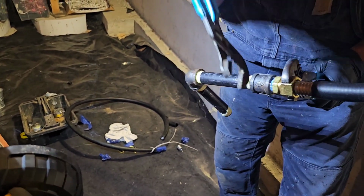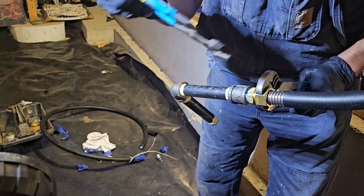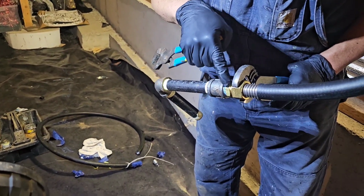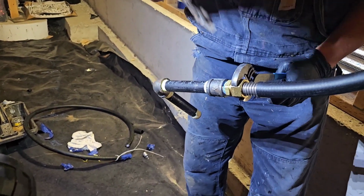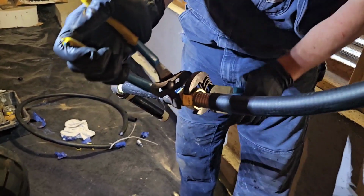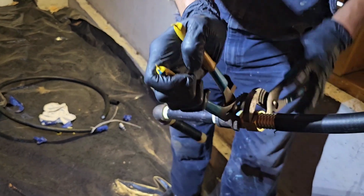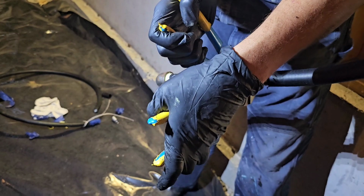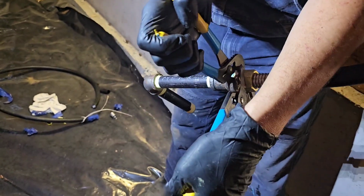Important to tighten the nut too, the nut, not the material. We're just trying to sandwich that stainless steel to the receiver part, the tapered part of this stationary fitting. Don't take the stationary fitting and do a bunch of twisting. That doesn't make for a great joint. Worst case scenario, I suppose you could do it. In all cases, try to just work the nut, because that nut is just jamming those two half rings closer to that tapered part. It's making a great seal.